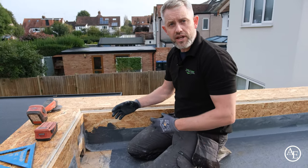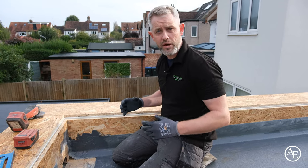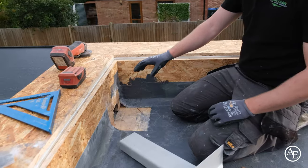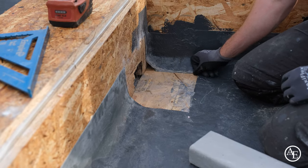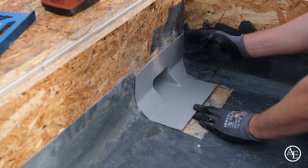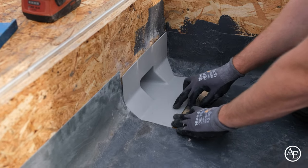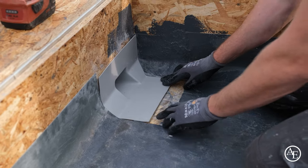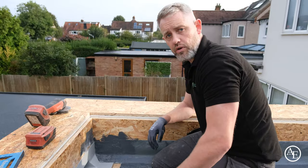We're now putting the outlets on. We had a time constraint due to the weather, so we got the whole deck waterproof first. We've dried the deck off and we're retrofitting the outlets — we've put the hole through the wall, cut back on the fillet trims, and kept them quite far back so as we put the outlet in we can get a nice seamless finish with the fibreglass down both edges. We've also taken it down a little bit on the front edge so there's no lip to stop water impeding the outlet.